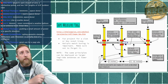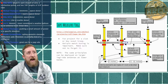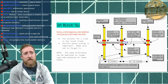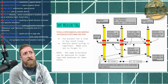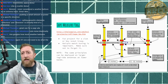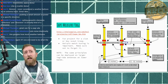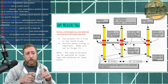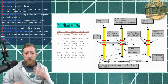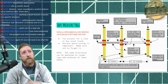That example comes from that URL, which I will put in the description. If you look up tape measure Yagi plans, you'll find this, and this image was lifted off their site. It explains exactly how to build it. It's a fun project for your personal use, for Cub Scouts, for ham clubs. There's lots of reasons to build these, for fox hunts. It's kind of one half of a satellite communication antenna. If you were going to use one Baofeng for receiving satellites and one Baofeng for transmitting, you would just build a UHF tape measure Yagi and a VHF tape measure Yagi, and then use one for the transmit and the other for the receive.